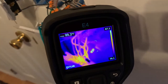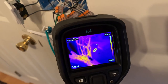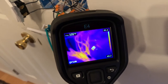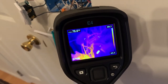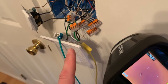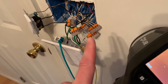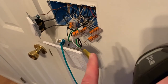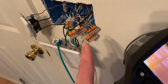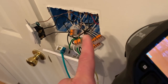I'm actually surprised that a resistor with this high of a value even worked. I thought I was going to have to pass more current through it for it to detect that I had turned the dummy circuit on. I searched online and couldn't find anybody that had encountered the same problem. But if you've got one of these TP-Link three-way smart switches and you're trying to do something similar, just add a 100,000 ohm resistor between neutral and one of the traveler leads and you're good to go. I'm going to shrink wrap this guy up and extend the lead so I can have it properly stowed in the box. Hope this helps somebody out. Take care, guys.